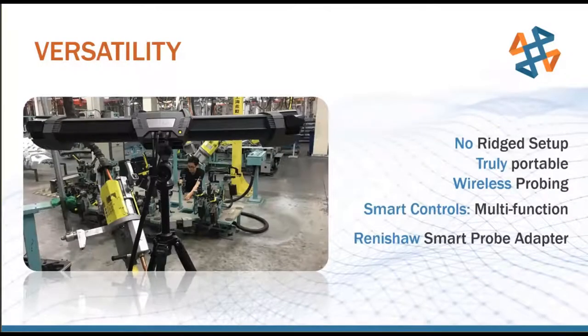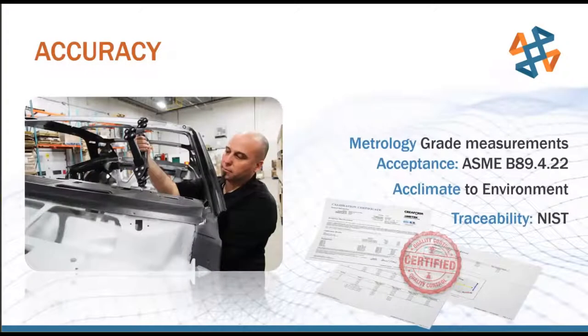So you can see we're using that on the shop floor. Same thing. We've got the C-Track watching us as we probe our part in the volume of the C-Track's cameras. This probe is metrology grade as well. Same thing with the certifications for keeping them up, keeping your paperwork up to date year over year. And again, if that's not required for your business, you don't need to do it. You can just stick with the user level calibrations that come with the scanner itself.